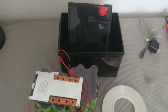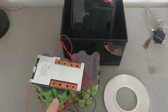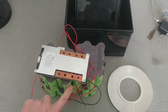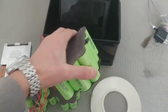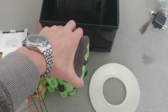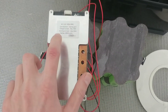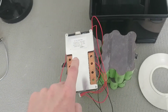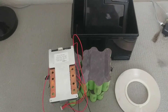Good day everyone. Today I'm going to be building a 12-volt battery that will be able to start the V8 Camaro that I have. I'm going to make it out of LiFePO4 cells — they are A123 26650s. I was able to find them on eBay; they come in four different modules, all connected in parallel. I also found a 4S BMS, 330-amp continuous on the discharge side, and it can do over a thousand amps burst. I was also able to find the battery box to package this neatly into, so if you're interested, stay tuned.